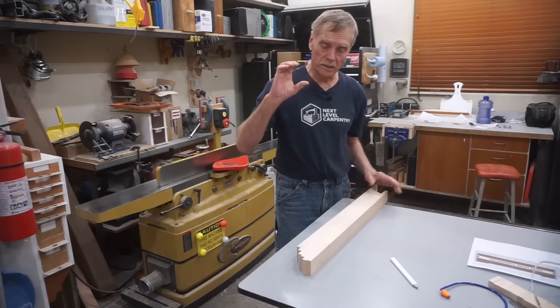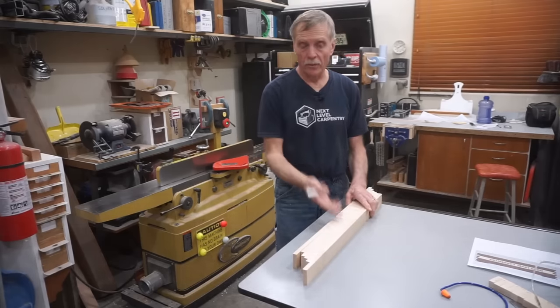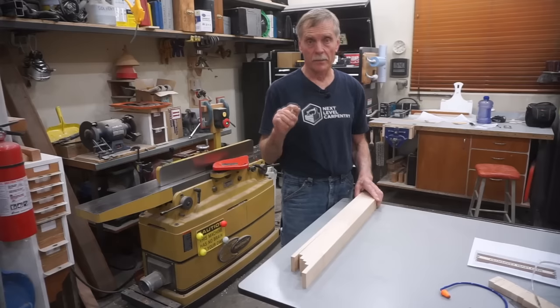And they're all 1/16 thicker or wider than they need to be. And I want to plane both edges in the thickness planer, which I'll use as a widthness planer, so that all six pieces are precisely the same before glue up.